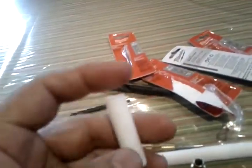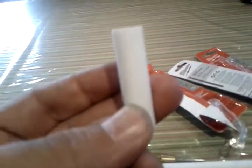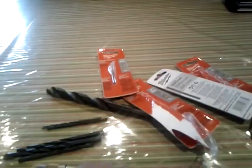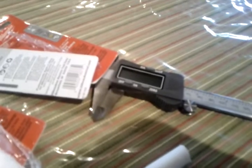You'll need some scissors for cutting Kapton, and a utility knife for forming the PTFE tube in the drill press. We're going to take off quite a bit of material on the last ten millimeters, taking it down to an eight millimeter diameter to help it fit into the smaller neck on the brass coupling, and it will butt up against the threaded part of the MIG welder tip. You'll need something to measure with if you care about precision, otherwise you can eyeball it. And of course you'll need the drill press, which is outside. That's it for now.